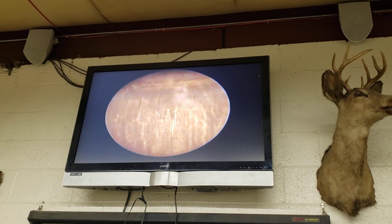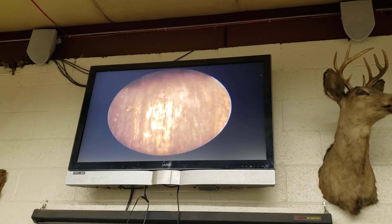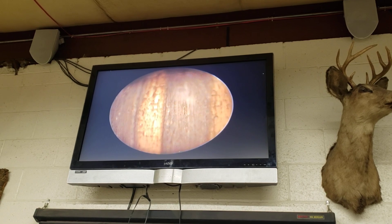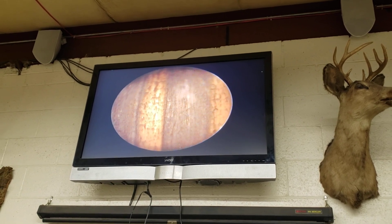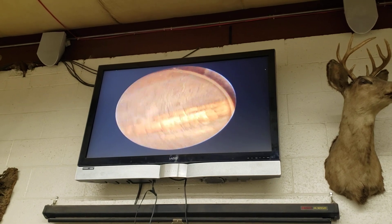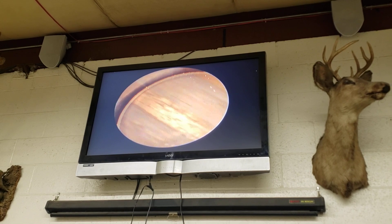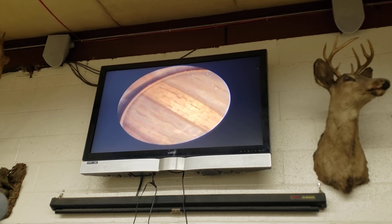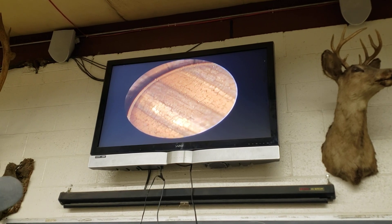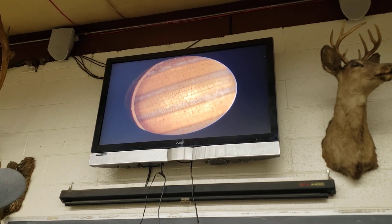You can see this incredible distance as the throat erosion has happened. As we travel down past the throat erosion, we start to see where there's a little bit more substantial lands, but they still have a lot of erosion and very bad firecracking. We'll travel down the barrel looking at the lands and grooves and firecracking — this is pretty much to the entire length of the bore.